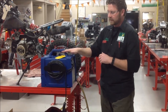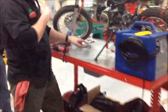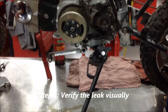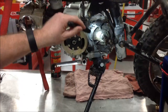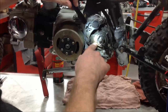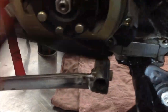The first one not everybody's going to have, and it's a smoke machine. We're going to pressurize the engine case. Come over here — we've had some oil sitting on the bench here for a few days. It's been dripping. We've removed any covers, and when this was all covered up, we had a quick guess that the sprocket shaft was probably leaking. We could see at some point a lot of chain lube or something has collected in here.